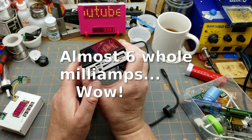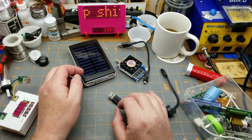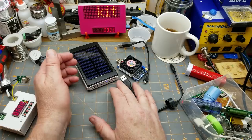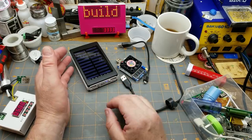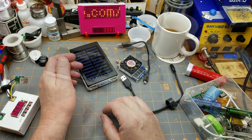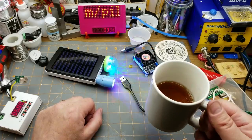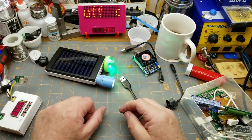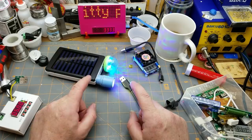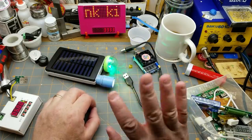The solar charging sort of works, but only just — it's only putting milliamps into the battery and will never meaningfully charge it. Verdict: if you ignore the solar panel, it's an adequate power bank for what it is — a cheap crappy power bank that lies about its specifications. If you think about it that way, it's not bad. If you're expecting high quality for hundreds of dollars, obviously it isn't. I paid less than 10 bucks for it. It was kind of fun to put together, a little frustrating. Thanks for watching — throw any comments, safety concerns, or questions down below. I'd love to hear about it.